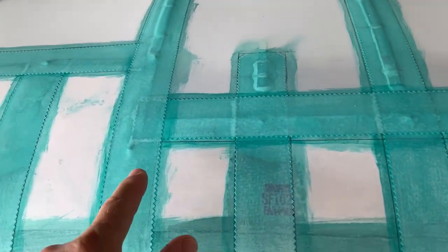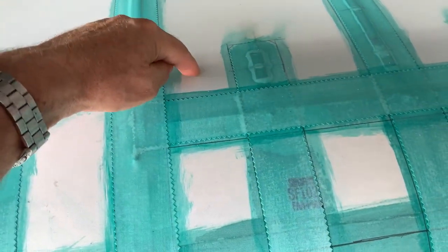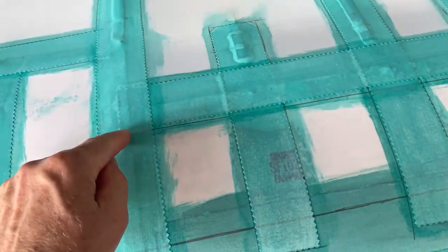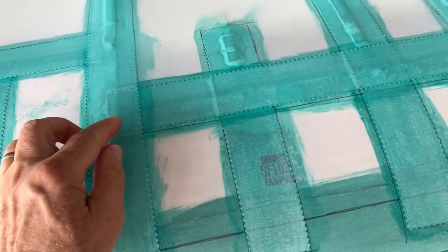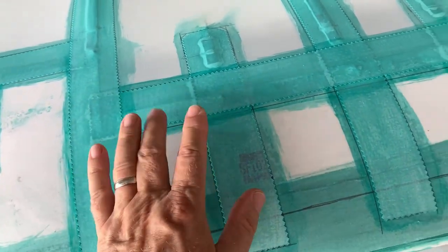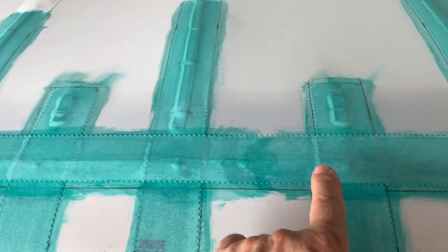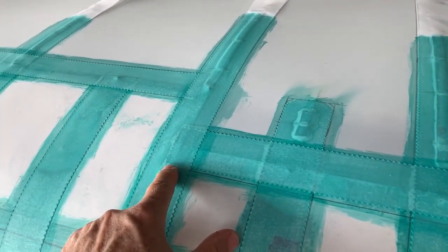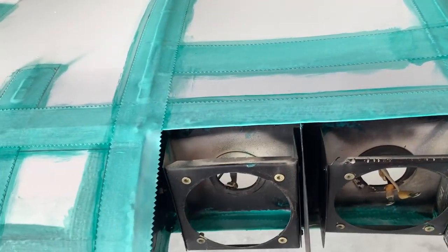The same was true on this tape here that runs from, because there's no metal underneath here. Metal is here and here. But here's of course the metal edge. So I put reinforcement tapes. So that reinforcement tape goes over all these tapes that go across the wing, but it terminates under the tape here, and it terminates under the tape here. So there's a certain sequence.